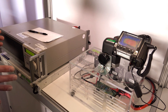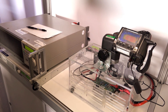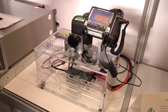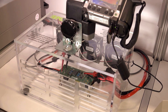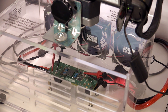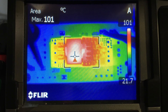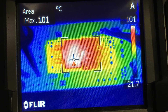What we have here is our demonstration of the 8th Brick running as a DCX. Over here on the left, we have a power supply and an electronic load. On the right, we have a box with the DCX running inside and some fans and a thermal camera. The fans supply about 400 LFM of airflow, which is something you typically find in a data center or telecom system. From the thermal camera you can see that the operating temperatures are around 100 degrees Celsius. The hottest part is the transformer — the FETs are actually running cooler than the transformer.